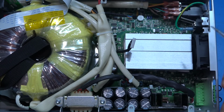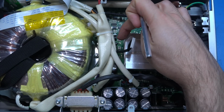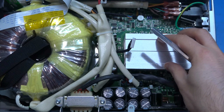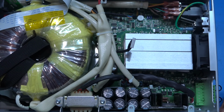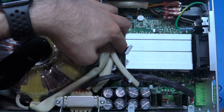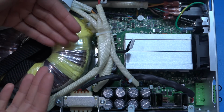Now this style of thermal management is also fairly common, where you have a fan over here directly pulling air through the heatsink. So there are fins in here which you cannot see from the angle, and that basically maintains this at a particular temperature that you want, and I'm sure there are temperature sensors monitoring it. And that removes a lot of the airflow from places you don't want it to be there. For example, underneath this, there are several big capacitors. These are also in the nice airflow path, which is great. Close them down and air probably comes down through this side and goes out.